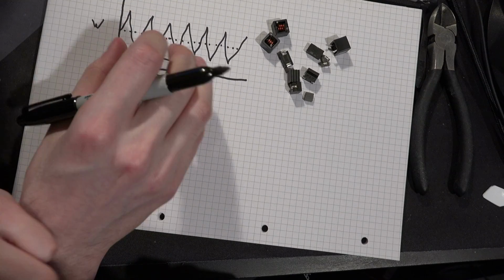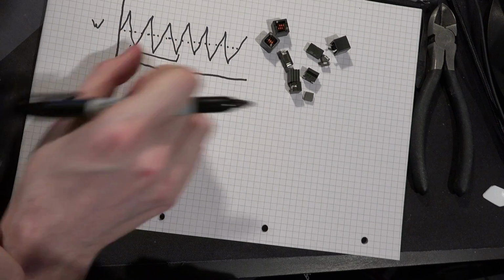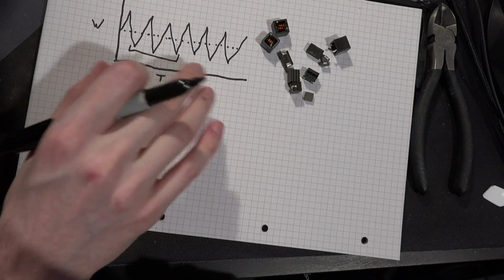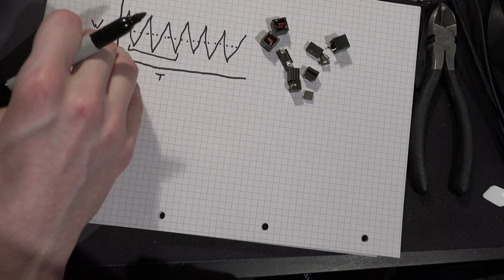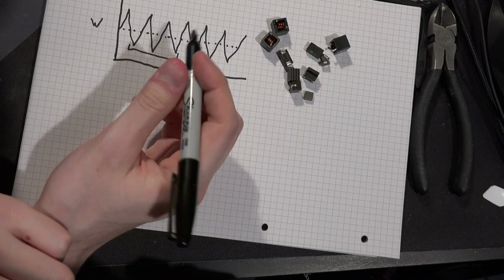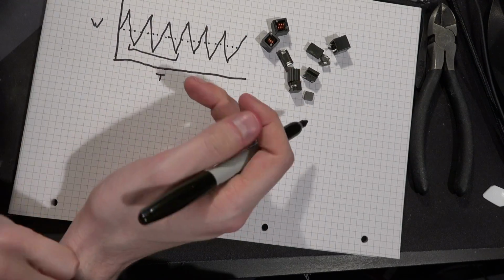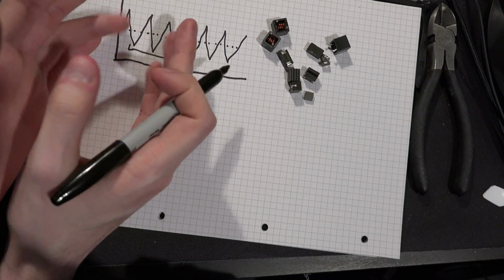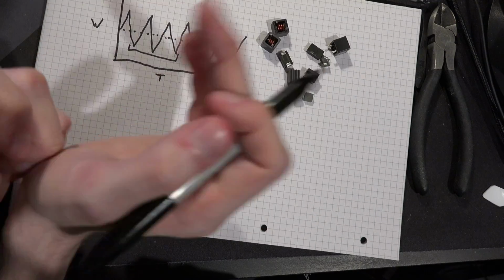But what's important is that the frequency of these spikes is based on your frame rate, right? Because through one frame render cycle, you're going to go through a full set of these operations, and a certain set of operations pulls a certain amount of power, unless those functionalities of the GPU aren't being used. So as your FPS cranks up, this compresses, right? Your spikes get closer together, and your coil whine gets louder. I mean, whinier, right? Because it goes up in frequency.